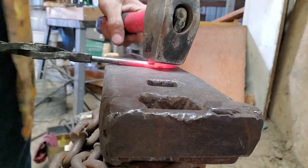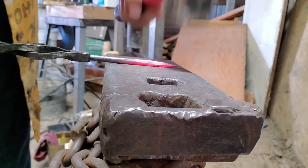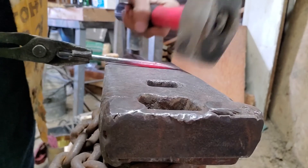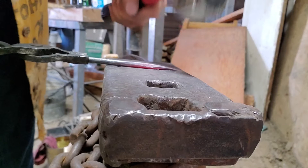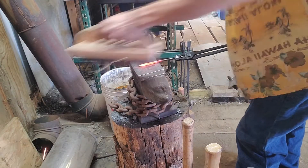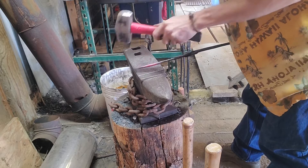In order to get this point to turn into a round instead of a square, here's where we're going to knock the corners off. I'm going to face it up on top of one of the corners, take the flat face of my hammer, and just knock that corner down all the way along the entire length of that point. This is going to turn it into an octagon, and once you've got it as an octagon it's going to be much easier to start rotating and turning it into a round.